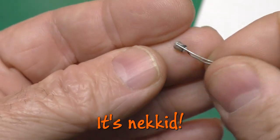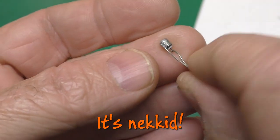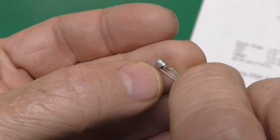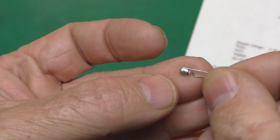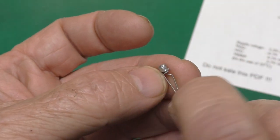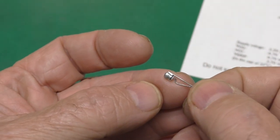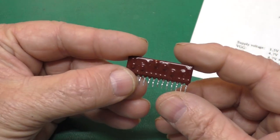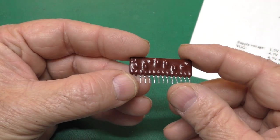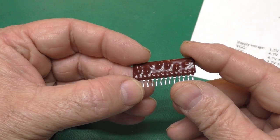And you can see it did effectively strip the coating off of here. It doesn't melt it. It makes it soft and crumbly, and you can break it off. This took about 3 hours to get to the point where I could chip all the stuff off this capacitor. So I'm thinking that's what we'll do now with this module